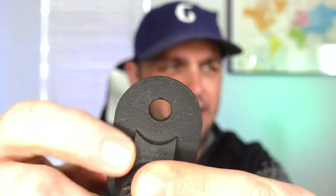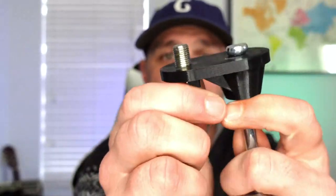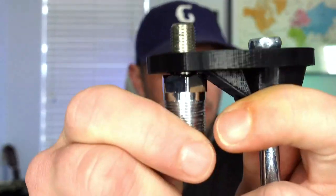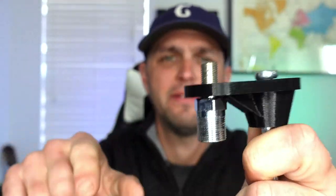I went ahead and added a little groove here, so when you put in your SO-239 to 3/8-inch adapter — let me show you — so when we put this SO-239 connector on with the 3/8-inch adapter, and if you have a wrench you could tighten it a little bit more, it actually makes it more flush. I assure you that it will go up and sit flush against the flat portion of the actual mount, which was wonderful, except I kind of messed up a little bit.